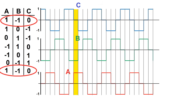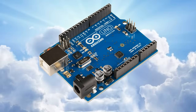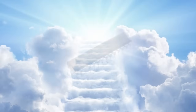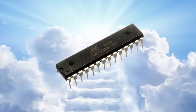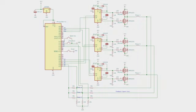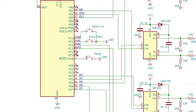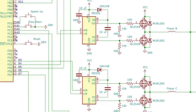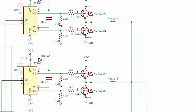Now I need something to switch them. The Arduino is my go-to microcontroller, but we don't actually need to use the whole board — all we need is the microcontroller on the board, the ATmega328. As you can see on my schematic from earlier, the ATmega328 pins control the MOSFET drivers, which in turn provide the pulses of current needed to quickly turn on the MOSFET gates to control the windings.